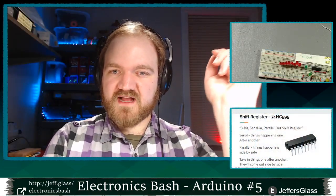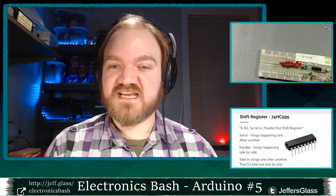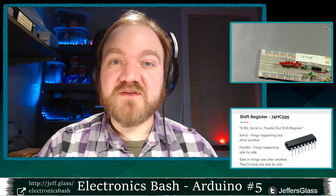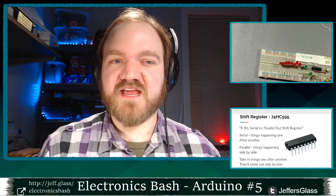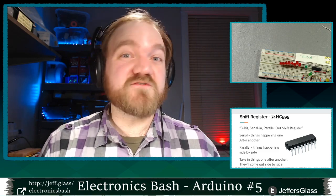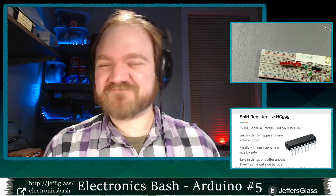Couple quick questions before we get back to the slides. Palmer says, my 8x8 is mounted on a circuit board with only VCC, ground, DIN, CS, and clock input. Yes, your display, Palmer, has a chip built into it that allows for some kind of serial control of that display. If it has a part number on it, it would be worth Googling that part number to see if you can learn if it's serial or SPI or one of the other things that we'll talk about next week. Spoilers.